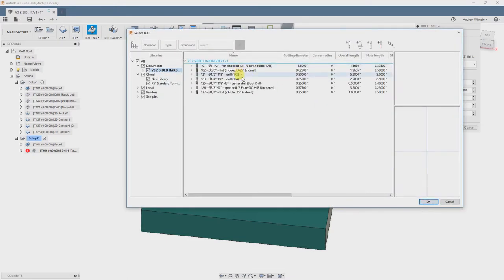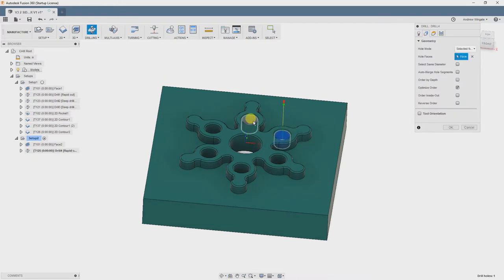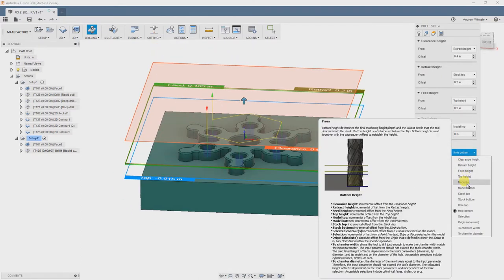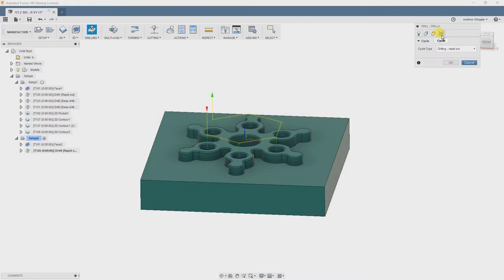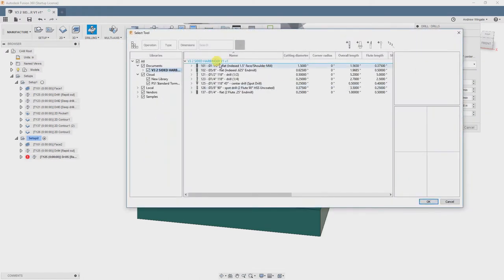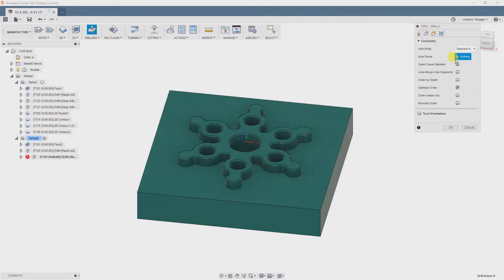Looks good, so let's move on to drilling those 6 quarter-inch holes. We always use a center drill first, so we're going to select the surfaces of our holes. Again, we'll notice that the holes themselves don't actually go to the right height — the chamfers make the tops of the holes a little bit shorter than where we actually want to be, so we're going to select Model Top. And for bottom height, we're going to go 35 thousandths deep, using the same reference plane as we did for the top height. Click the Cycle tab and verify that we have the right cycle. Next, we're going to be doing another drilling operation. This time we'll be selecting the quarter-inch drill, and I'm going to select the Same Diameter checkbox so that it'll automatically select all the holes with the same diameter.